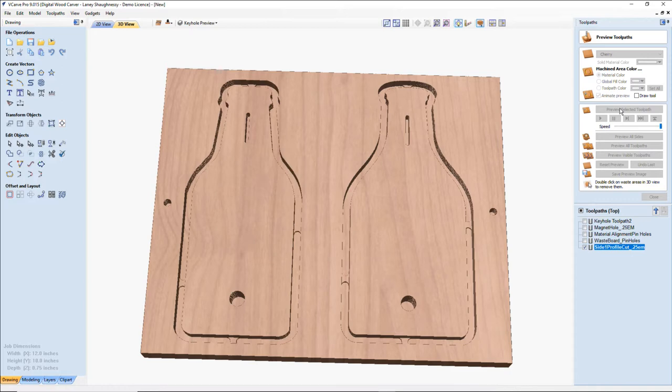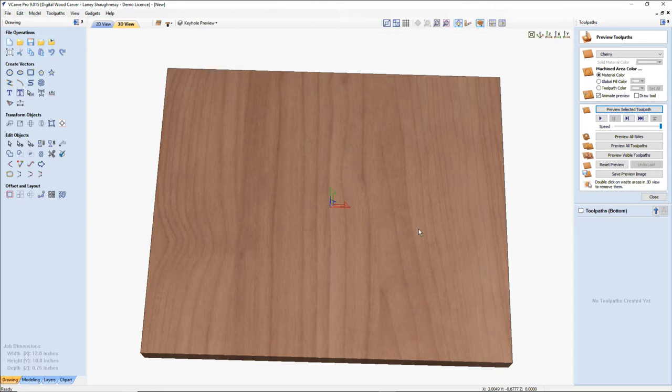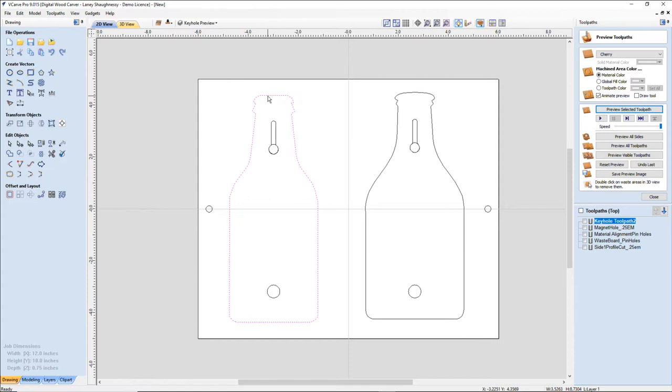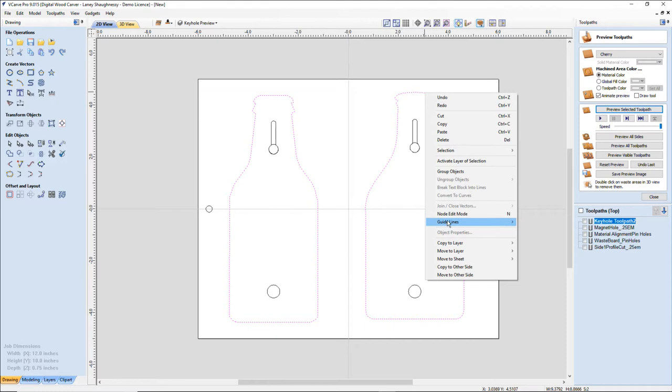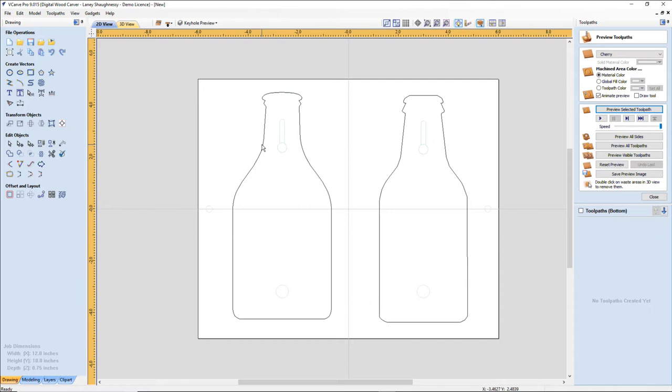All right, so now with this, if I needed to get back to it another day, you could. Let's flip it over to the other side here, and before we do, actually, I'm a goofball. We're going to take our shapes and copy them to the other side. Now we can flip over, and all we need to do is create our profile cut for this side and our V-carve. I'll go ahead and create the profile cut while I'm in the toolpathing mood.